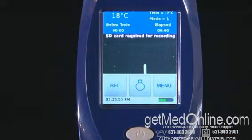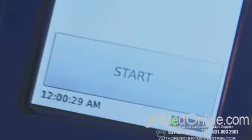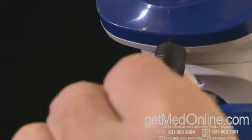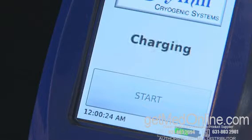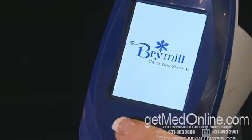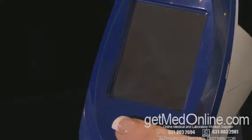To turn the device off, hold the button for more than 3 seconds and the unit will turn off. When the battery gauge on the LCD screen goes to 1 bar, the unit must be plugged into the battery charger and left charging for 4 to 5 hours. Overcharging will damage the battery if not charged properly. If the unit is to be left charging over the weekend, hold down the shut-off button for 10 seconds — this will put the unit in a trickle charge and will not damage the battery.